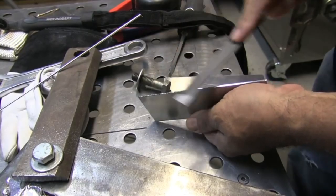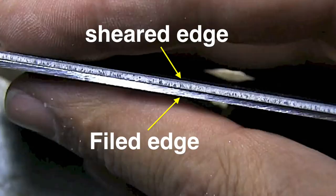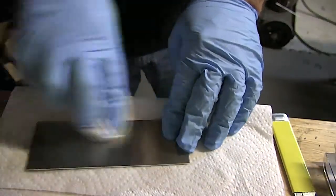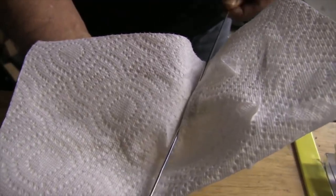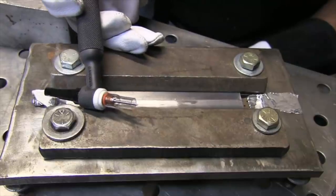Cleaning aluminum for a weld test that's going to be x-rayed is entirely different. In that case, cleaning the sheared edge is super important. A sheared edge is ragged — it could have oil and grit entrapped in it. If I had to choose one thing to do and one thing only, I would file that sheared edge for a weld test. On a test, I would wipe it down with acetone first, file the edge, and then use a fine stainless steel brush at low RPM with low pressure so you don't smear any oxides into the base metal. Also make sure to wipe the filler metal. Every little bit helps on a weld test.